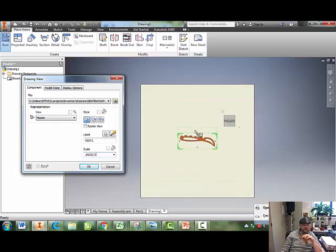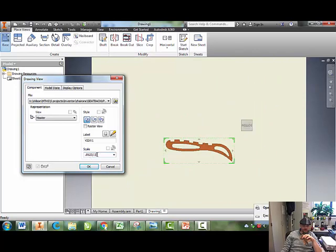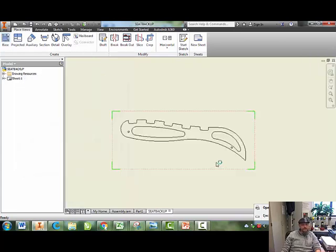So I'm not going to do all the math for you, but here's how you create your scale factor. The top number in the fraction is the thickness of the wood you're going to laser cut, and the bottom part of the fraction is the thickness of the wood that you designed your chair for to be ShopBotted. So do those measurements and do it right. All right, there's my scale.